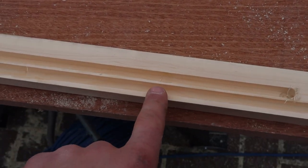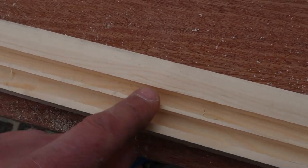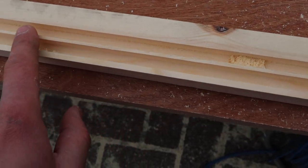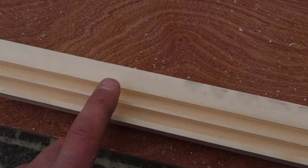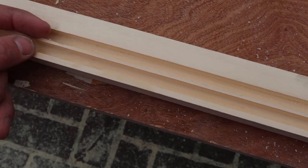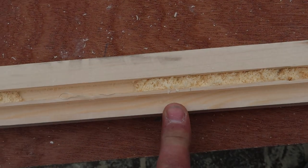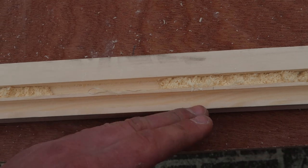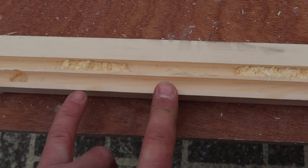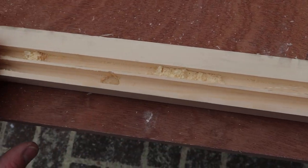So we've got the front slot. You can see how thin the middle section is, so we'll need to be careful, but once the doors are in that'll be fine — it's basically just a guide rail. We've got the two 10mm slots here and the 9mm ply doors will sit in there. Because it's so thin in the middle the doors will sit quite close together. The reason the first slot is so close to the front is because these cupboards are going to sit behind kitchen cabinets, so the doors act as the backboard of those cabinets.